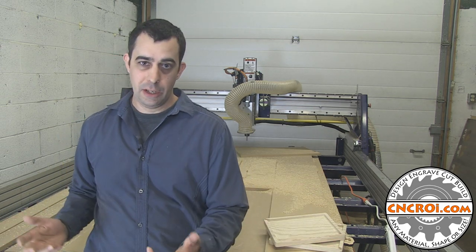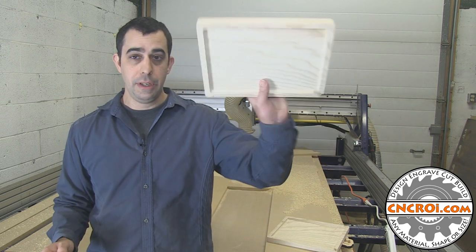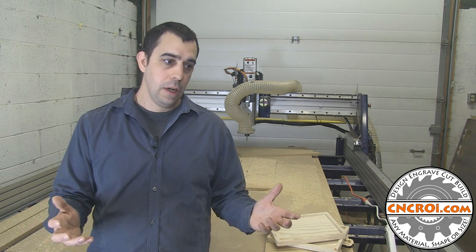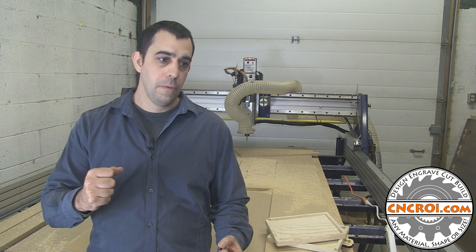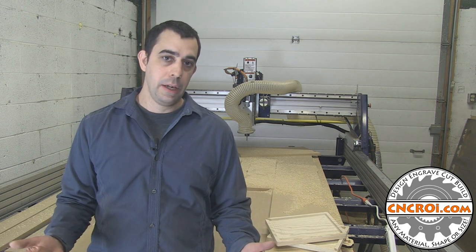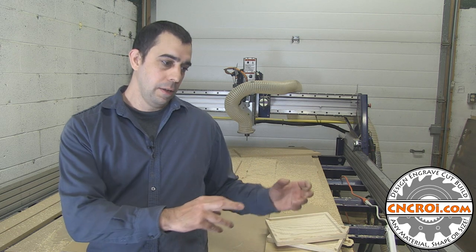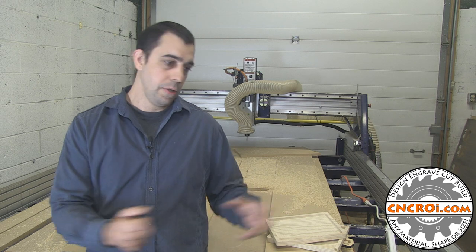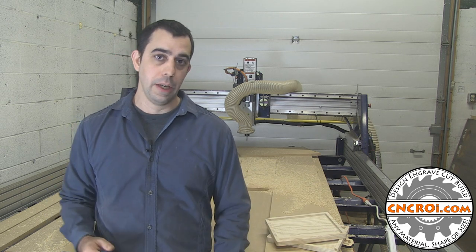Now you might think that's not a big deal, but it actually really is. Let's say we're making 50 of these things here. And right at the beginning here, for whatever reason, something goes out of alignment. It could literally be anything. And what would happen is that we would do the whole project, and then we find out we're out of alignment, and everything that we made was scrap. Now, because it's self-correcting, only one piece of scrap that we make is the initial one, because then it goes, oops, okay, I bumped, go back to where I'm supposed to be, and do all the other units perfectly as they should be.